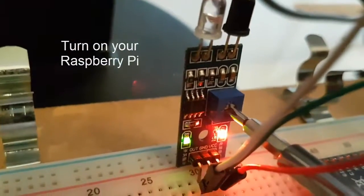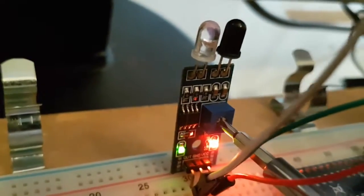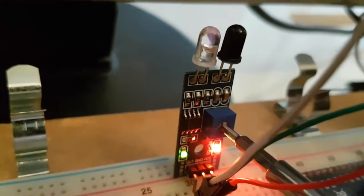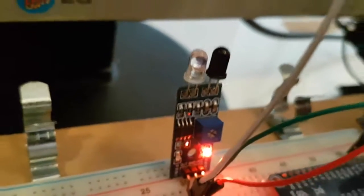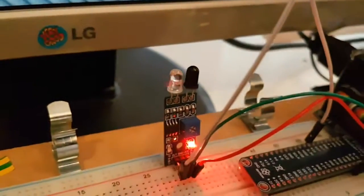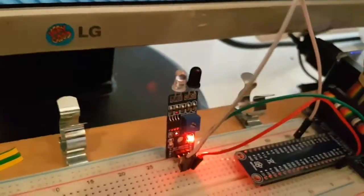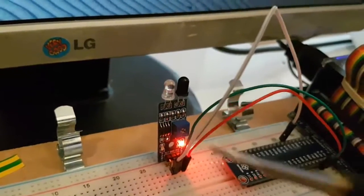The red light on the right is the power and the green light on the left means it sees something. There's nothing there right now, which means the sensitivity is not right. So I'm just going to use a screwdriver and turn it anti-clockwise so that light goes off. Then I'll test it by putting my hand over it — what should happen is the light bounces off an object and comes back to be detected. There it is, working just fine. You can adjust the distance sensitivity using that dial later on.